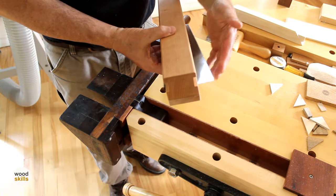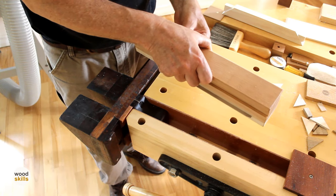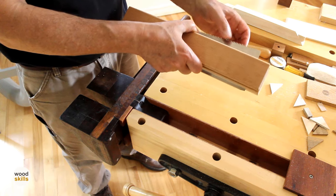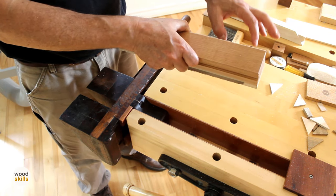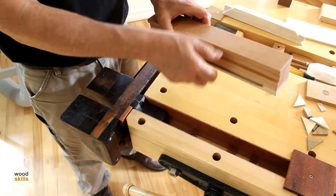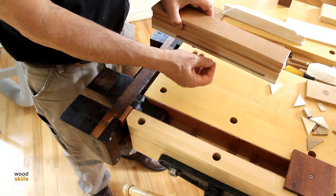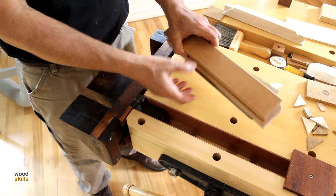It's now configured for the rip side. The rip teeth are more exposed. Again, the teeth are graduated on the Ryoba blade itself, and there's a little more exposure at the top, so you can start to cut down here, and it's tighter. And you still have some crosscut teeth exposed here if you need to start a cut using crosscut teeth. So that works.